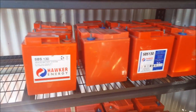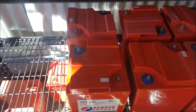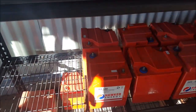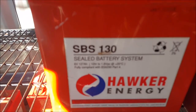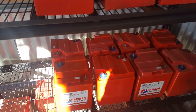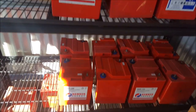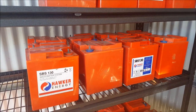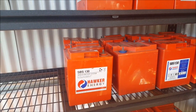I'm just going to have 8 batteries per shelf. I've got to get some copper to link the batteries up. Very important: each bank is going to have its own fuse. These are 6V 127Ah batteries. 6 eights is 48 volts, then I'm going to have 4 banks in parallel, and that will give me 508Ah at 48V — just over 24 kilowatt hours. I don't want to go below 70% state of charge, so that will give me about 7.3 kilowatt hours that I can use.